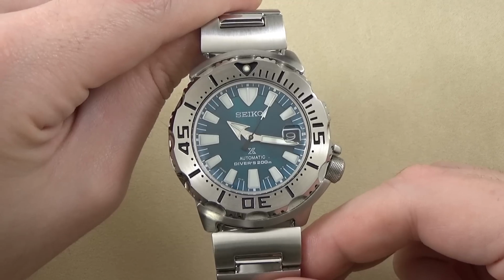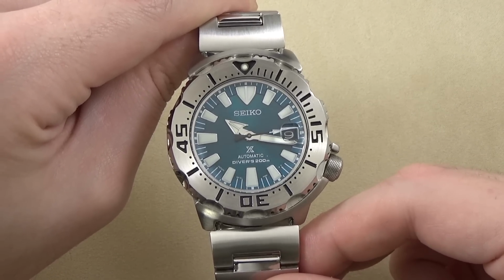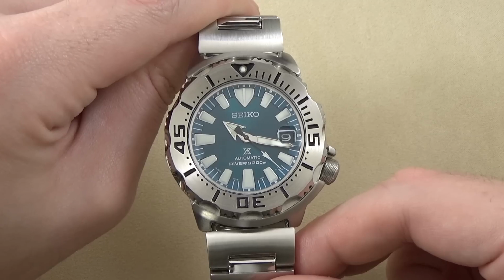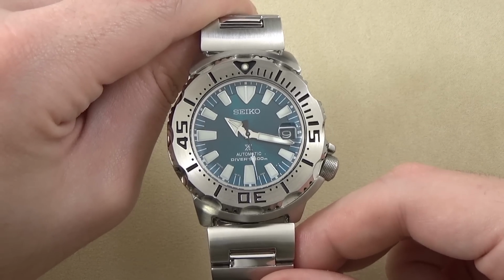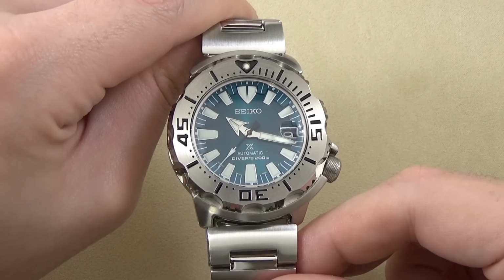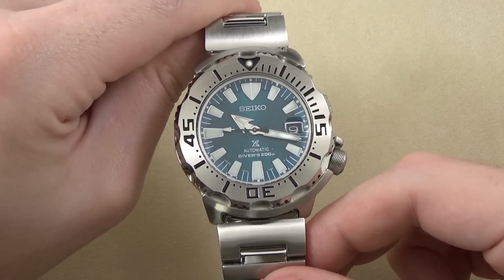When they do work, yeah, they work fine. They're generally so-so when it comes to accuracy. I have some Seiko watches that have been plus 5 seconds per day, minus 5 seconds per day, in that ballpark, but I've had others that I've regulated to be very, very accurate, only to find some months later that they're suddenly plus 50 or plus 60 seconds per day, or worse. When I put them on the timegrapher, they'll run very, very fast, maybe plus 60 seconds per day for a minute, and then they'll slow down and run plus 20 seconds per day for 30 seconds, and then swing wildly to some other rate with no discernible explanation.